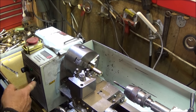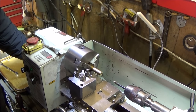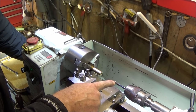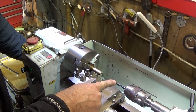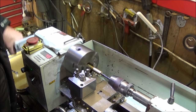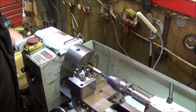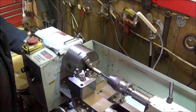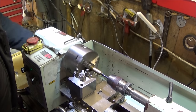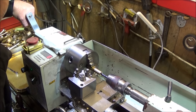So I've got the lathe in neutral, the handle on the back, a test piece of brass in the chuck that has been drilled for the core diameter for a quarter UNC thread. And you basically wind the handle, the tap feeds into the work like normal, but you can obviously reverse it whenever you like and clear the swarf, and you have a great feel of the work, less likelihood of actually breaking small taps, particularly if you're going into a certain depth.